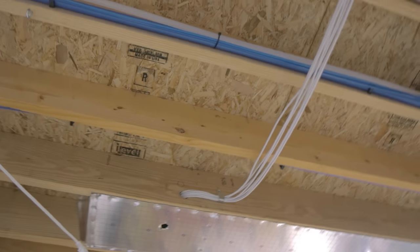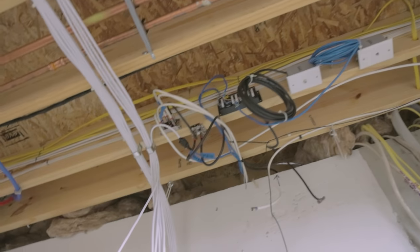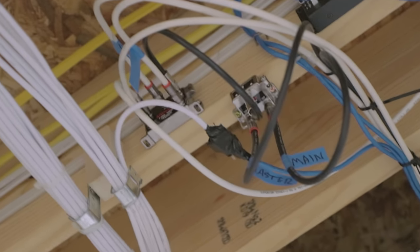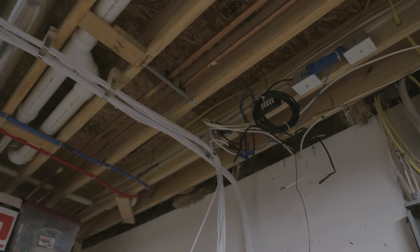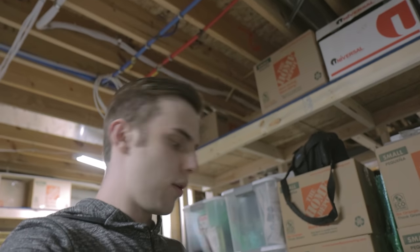We ran all of the cables up to the attic and finished the lines to Mr. Evans' office, coming over into a second bundle. I tapped into the line already going to the living room — I put a keystone on the white cable and a male termination on the blue cable, so those are coupled together and taped in place. One thing to note: I don't tape the plastic clip so it's not always pressing down and releasing the connector. Tonight I'm going to finish putting in the last patch panel — I need to figure out where each line goes, label them, put them in the patch panel, install it in the rack, dress the cables, install the Dream Machine, and connect everything.